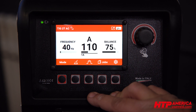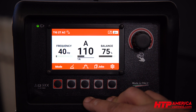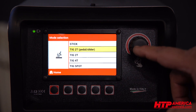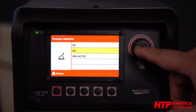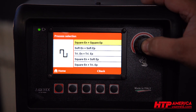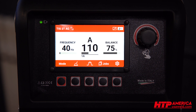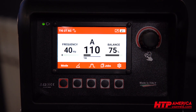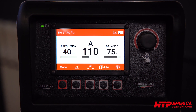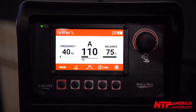We're going to make three different welds on three different pieces — all the same length, the same temperature, from the same cut from the same piece of stock. First, we go into 2T pedal, then AC standard, and we're going to pick a square wave on both sides, high frequency start. This is basically how most regular standard welding machines would be set up. We'll be running about two inches of bead without any filler, trying to do this at the same speed every time. This is our first setting.